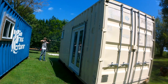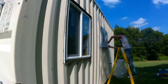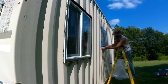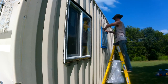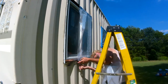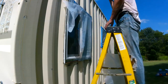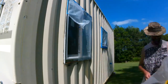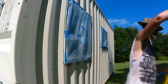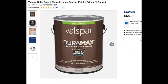The paint we're going to use is nothing special — no custom paint from a custom paint store. I'm using Lowe's Valspar Duramax exterior paint, paint plus primer. There are already good primers on your shipping container, so as long as you've hit all the discolored spots and rust nicks, you don't need an additional primer. The paint I went with is about $55 a gallon — $54.98 to be exact. I needed three gallons, so for around $165 plus tax I've got a full paint job on this thing, plus sweat equity.